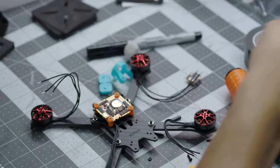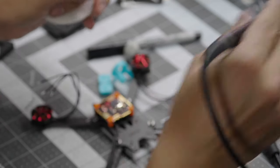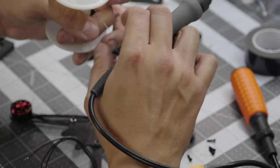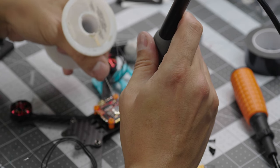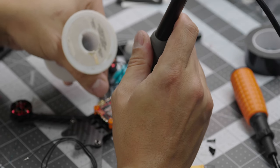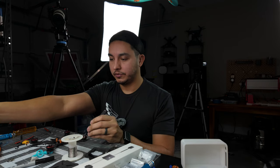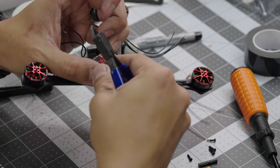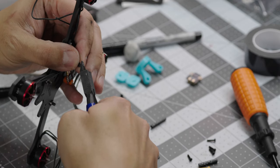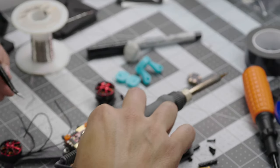The next step is to pre-tin all of these motor pads and get that AIO nice and warm, because we're going to be dumping a bunch of heat into this as we solder up all of these pads. I typically just tin it from the side because these motor pads wrap over the side, and then I have the motor wires come up and solder to these little grooves inside. For the wires I put under the AIO, I don't usually trim those — they're just the perfect length. What I do trim is the pre-tinned portion of the wire, just because it ends up a little too long. You want it to be about the thickness of the AIO because it's going to go into that groove.